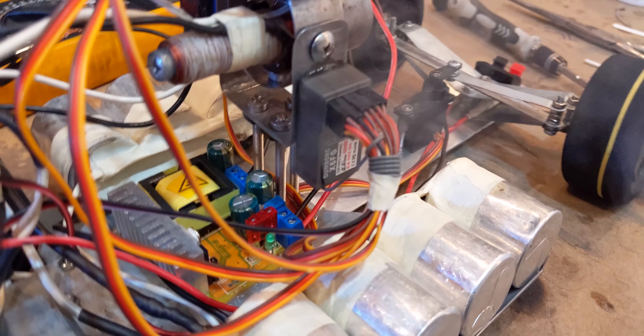In the middle of all that, one of the capacitors from the charging circuit started to smoke. It was expected because it's rated for 390 volts and I had cranked it up to 800 volts. To fix it, I soldered a new capacitor with the same voltage rating and it was working fine. These are the projectiles that were used. That was the coil gun on an RC car project. There was a lot for me to learn from this because I never used this many modules on a single thing, so it was quite an experience. Thank you for watching and I'll see you guys in the next one.